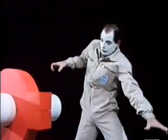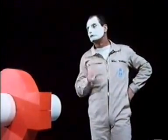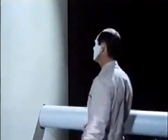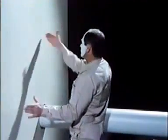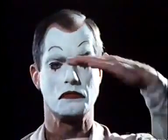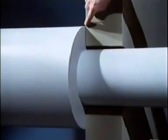But now the shaft will no longer turn. Rotation and sealing — can they ever be compatible? The shaft requires clearance so that it can rotate. Seal faces not parallel with, but rather perpendicular to the axis. That's the answer. The housing and the shaft boss form the seal faces.